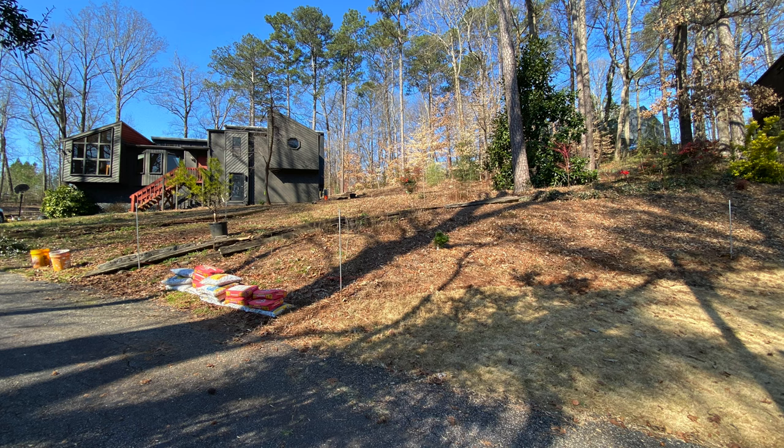We would be weeding on this hill normally. It's at a slope, it's just hard to manage. So we wanted to flatten it out so that we had better accessibility. It was definitely too much of a slope to have the grass continue up and just mow it. In this situation we are going to be doing a 30-inch tall planter bed wall, not a retaining wall — just under 30 inches. The reason for the 30 inches is by code in our area: if we go past 30 inches, it's considered a retaining wall. It has to have permits, groundwork, ground percolation tests, assessments of where your property lines are — a big mess and a lot of cost. So we're staying under that.